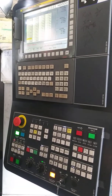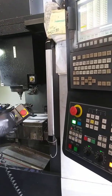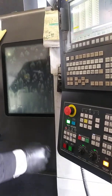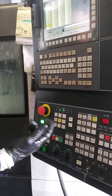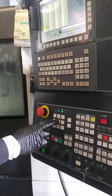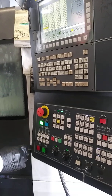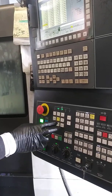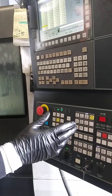There is no fucking automatic power up bullshit. What I like to do is when you're done, just get it up a little bit - you always get it up. If you're ever scared, shut it off, whatever. Close your doors. Reference Z. Got it. Reference Y, come back to me. Jog - I can move the table left or right, X. Don't ever wrap it with Z - no, the Z goes to negative. Any time I do a Z, I always just reference Z. It's just easier. There's no reason to fucking wrap it on Z, it's pointless. It would almost be dumb if you ever want to do it.